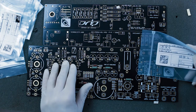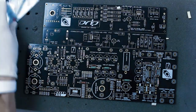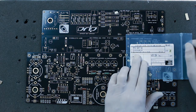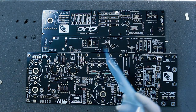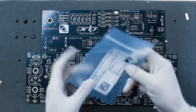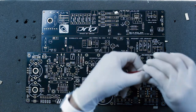The next 620 will be between the interstage and the EQ input transformers. The next item is a 4.7K ohm, 1 watt — those are right above the two tubes. The next resistor is a 43.2K ohm, which is the closest I could get to 43K, and that's right above the 12AX7. The last resistor is 75 ohms — that's a 0.7-inch bend.